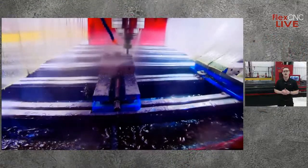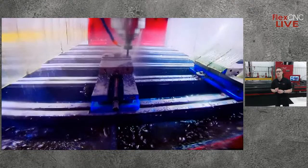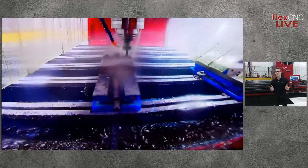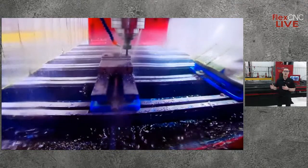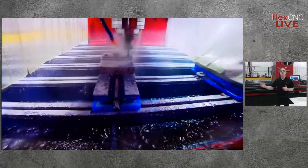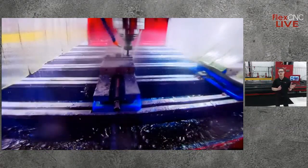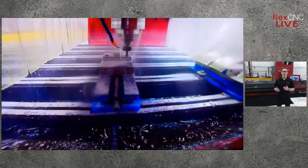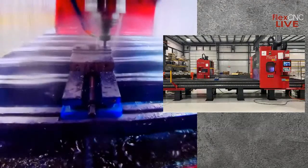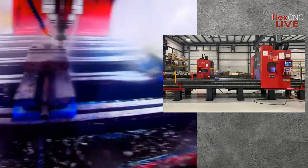It's a great option. It allows you to process in the machine using zones to eliminate the need for the machine to be down. You basically get 100% spindle uptime while the part is running on the other side or in a different zone that you're not working in. You slide that light curtain barrier down, and as long as you're outside of that safety barrier, you can be loading and unloading parts while the machine's still running. So it essentially acts as a built-in pallet changer, if you will.